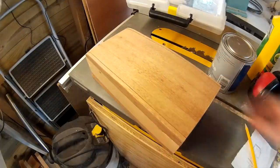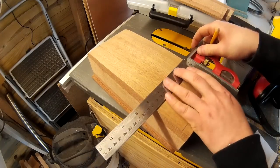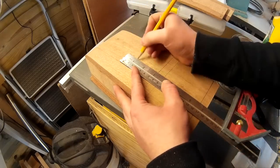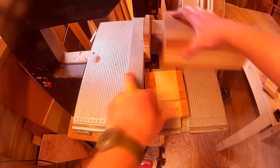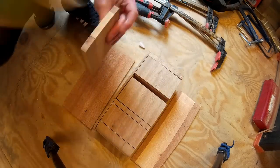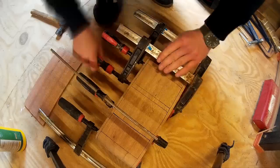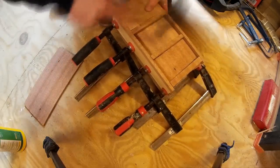With the rear and side panels cut, I marked up the cuts I'd need to make to create three drawers. Then I made those cuts. For some reason the blade started to drift again at this point — I don't know how or why — but rather than get hung up on it, I decided to just not use the fence anymore and to carefully push the wood through at a slow angle to counteract the drift, which worked fine. I applied glue to the drawer separators and clamped the sides to them with the drawers in place so that they would be in the right position. Then I eased off the clamps so I could remove the drawers, being careful not to move the position of the drawer separators.